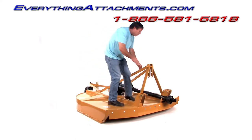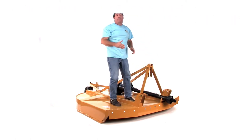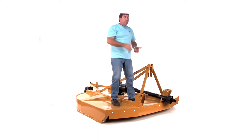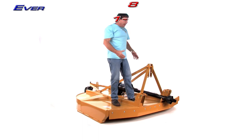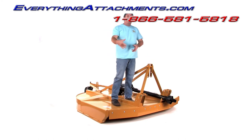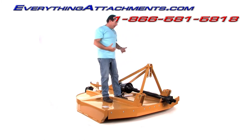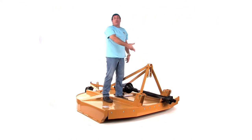We've also added a nice little pocket here to set the drive shaft in. I've seen a lot of these lost over the years where the farmer, the customer, lost his front half because he hooked the chain to the top. When you go down the road, it'll bust the little plastic piece where the chain is held. That chain is there to do no more than keep the cover from turning — one chain is supposed to be hooked to a lift arm on your tractor, the other chain around this bar to keep the shield from turning and wrapping up grass. But we do hook the chains together so the shaft doesn't pull apart during transit.